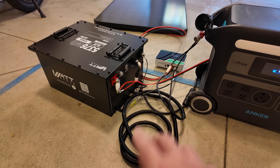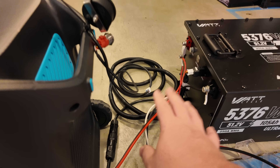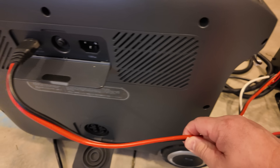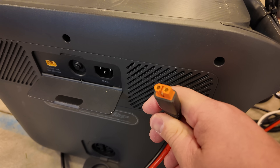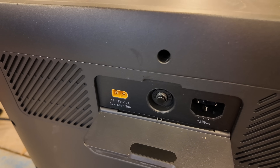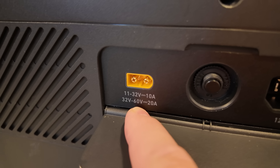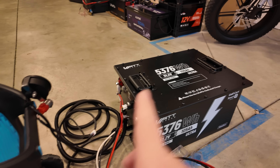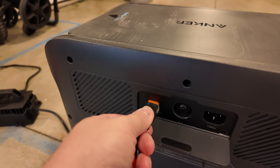All you do is get a fuse or two and wire up three things. The first is a cable like this — in an RV you may want one slightly longer, and I'll leave a link to different lengths. This is a heavy duty 10 gauge cable. If I unplug it, you can see it has an XT60i connector that easily plugs into the DC input on the power station. This hack works for any power station rated up to 60 volts of input, because this battery when fully charged can be up around 58 volts for a short period.